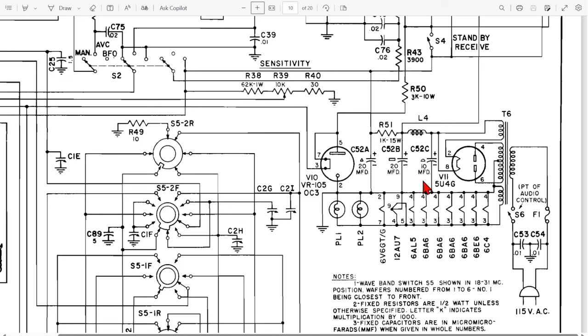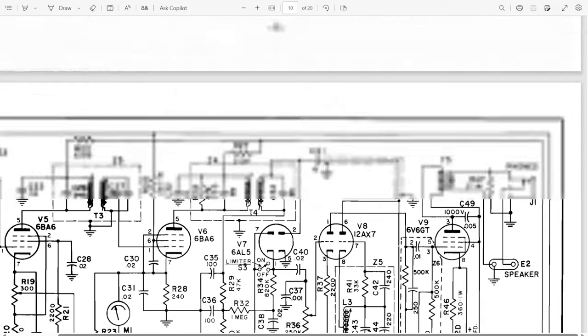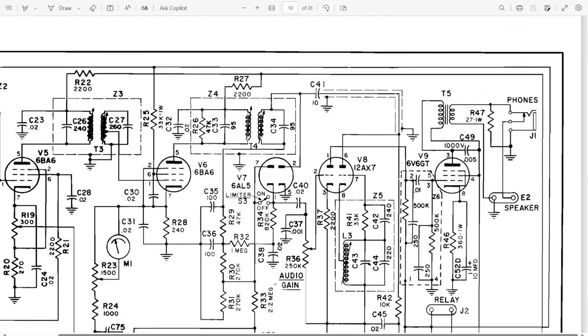So I think that's going to be step number one for this radio: we're going to fix up the cord, we're going to fix up this resistor, and we're going to recap that there and check the tubes and whatnot. Probably move on and do some stuff around the audio tube like I usually do. Let's just take a quick look at it. I think somebody's already put a new electrolytic in down here. That looked like it was done okay. I'll just check it, but we'll go and do the resistors around the tube and check the tube itself. So that's going to be step one.